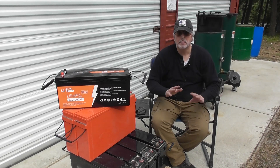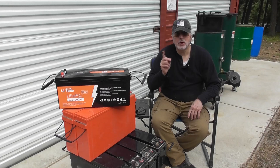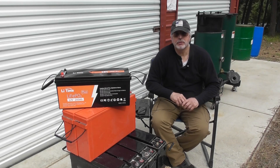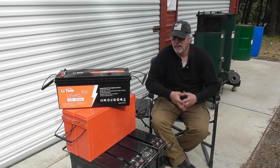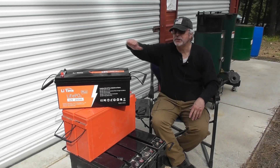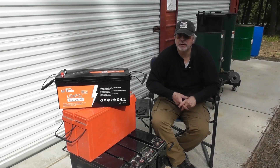When the lithium goes all the way to zero, the inverter charger completely shuts down. Even my remote monitor lost all of its settings — clock settings, everything — because there was no power left. What I've learned is I can't monitor voltage anymore; I have to monitor amperage usage and state of charge. Luckily, my Magnum Energy remote lets me switch the display to monitor state of charge. When it gets down to a certain level, I can decide to run the generator. These 200 amp batteries on a full generator bulk charge come back up to 100% in three to four hours.